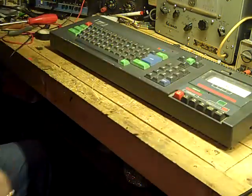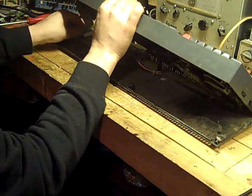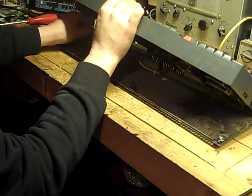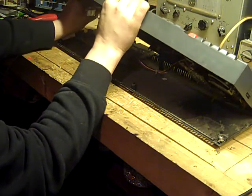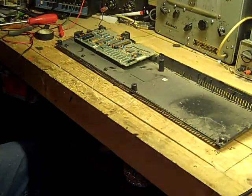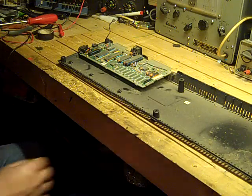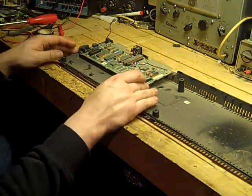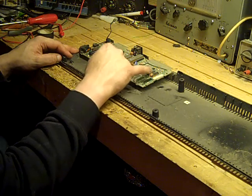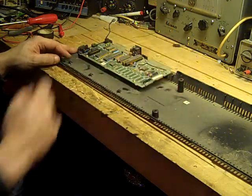Let's carry on. We'll gently disconnect the keyboard — there's a grounding pin up here. And we can reveal... it's the little one, the tiny tiny board. It's so reduced it doesn't even need many RAM chips — it uses just two 64K-by-4-bit RAM chips. I think the C64C uses a similar arrangement, but it looks like this board was designed to take either configuration, which is quite interesting.